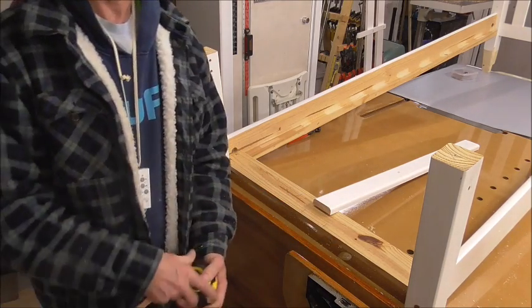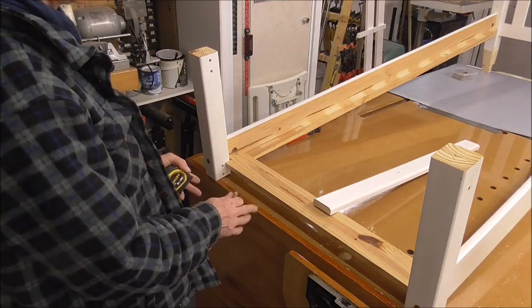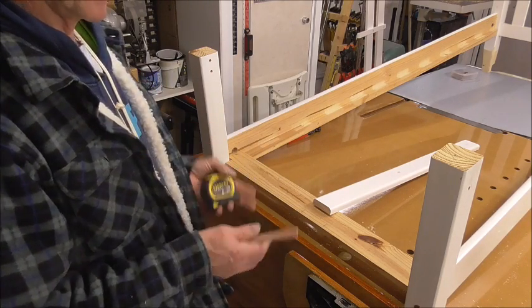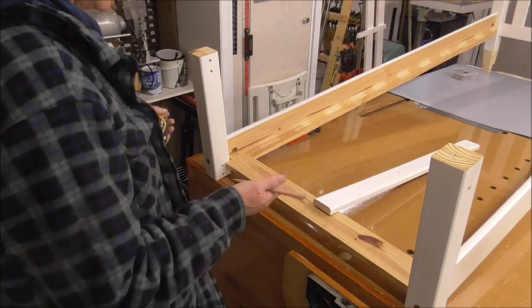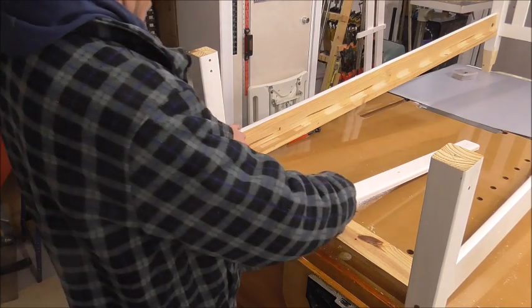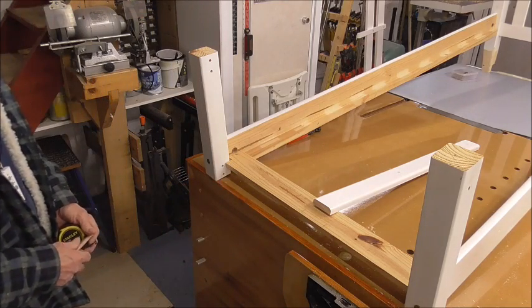Now remember what I said at the beginning about the ladder. I want the ladder to be standard like all the ladders I do, which is 300. It'll be 320 because I've got 300 plus the stretchers, and it's setting 10mm into each side, so it'll be 320 in total. And I've got to fit into that gap. And what have I got there? 350. So it will perfectly fit into that gap very nicely.